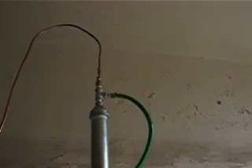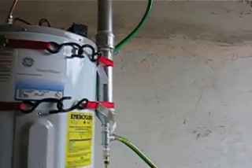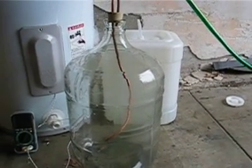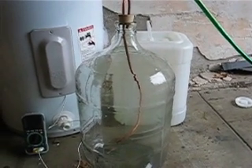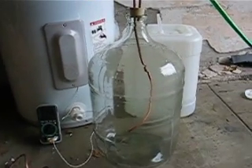That heat exchanger basically — vapors come through this copper pipe on the top of the hot water tank, through the heat exchanger where they cool down into liquid, and they're deposited as liquid into the carboy. This should happen at low temperature, less than the boiling point of water, because we're going to do the whole process under vacuum.